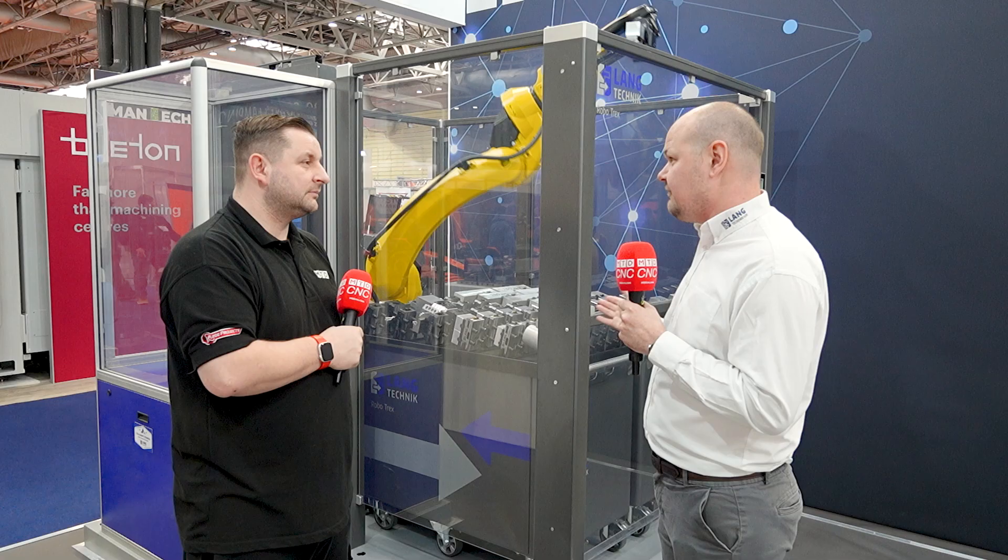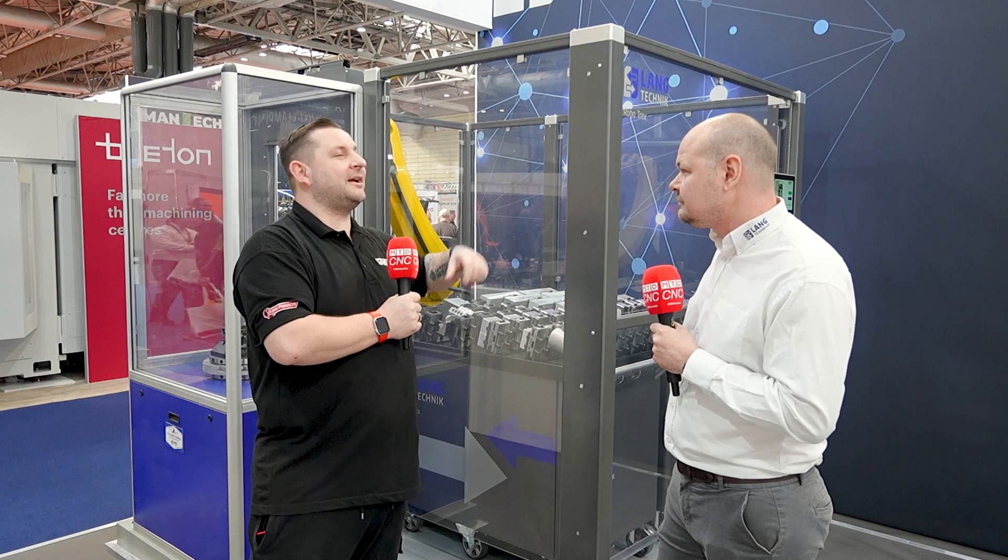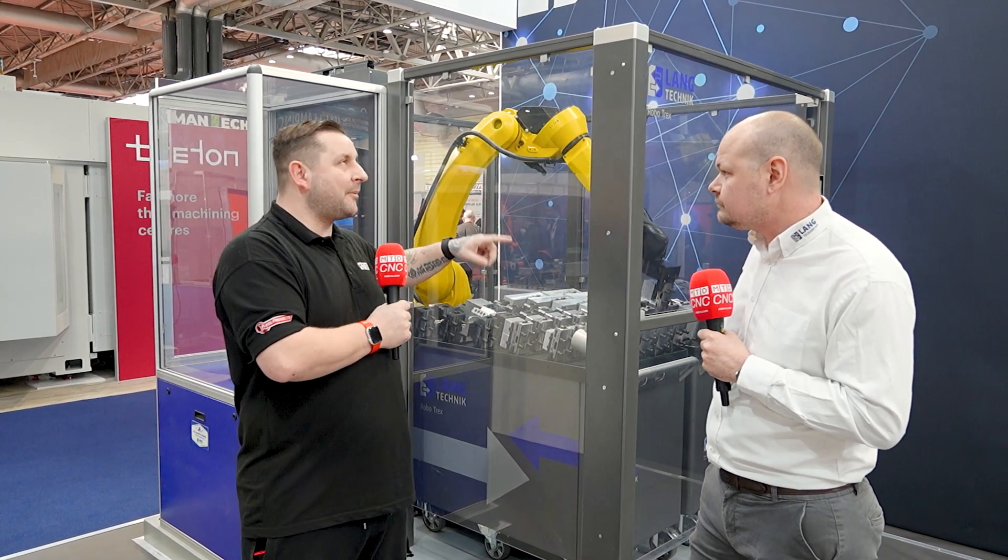One thing obviously worth covering is how this is run on your machine — do you have to retrofit your table, is there a lot of mess with hydraulics? Ours is completely unique in that scenario. It's the only system on the market that does not need any pneumatic or hydraulic feed to your machine table. Whether you've got a machine that's been in your factory for 10 years or a brand new machine, you don't need to order it with hydraulics or pneumatics — all of the clamping is done via the robot arm. If you've got jobs you prefer running manually, you can just undo a zero point plate, take off the automation base tower, and you're straight back to a manual machine.